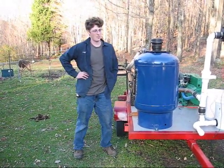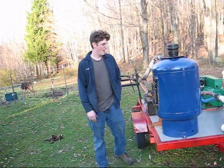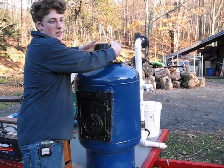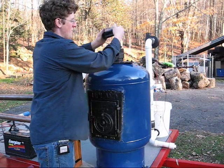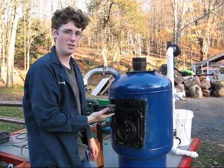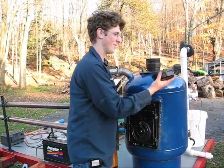Here's our stratified gasifier, made out of an old reclaimed well tank. Starting at the top, this is where you load the fuel, and it's also where the air is pulled in for combustion. I chose to use a four-inch pipe with a pipe cap so the shutdowns would be airtight and reliable. I plan on modifying this with an easily swung lid for opening and closing — for now, this is a good solution.